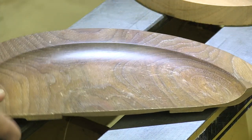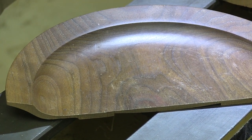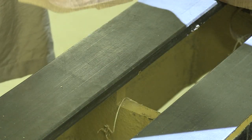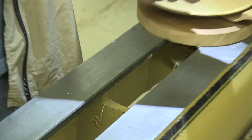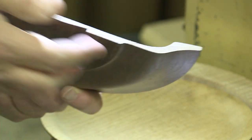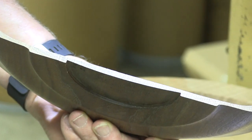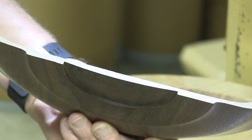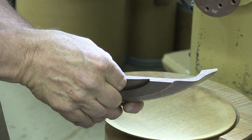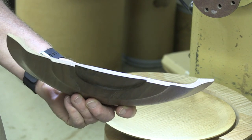Here's another walnut platter. It also is too narrow. Here's the cross-section that I had there. Again, there's the step in and this sort of donut thing, which is incanted. I've got a little bit of relief there that it bellies down, so the middle is thicker. I thought it needed that for rigidity. I don't think it does anymore. I can make this flat across and it works fine, as long as I have at least an eighth of an inch thickness here, and I use my 4-inch chuck. For that 4-inch span, an eighth of an inch is fine.